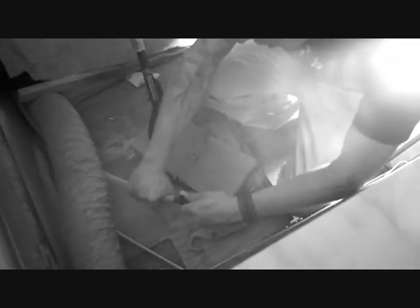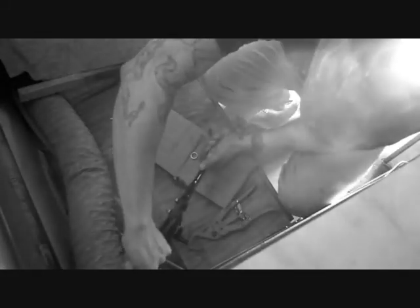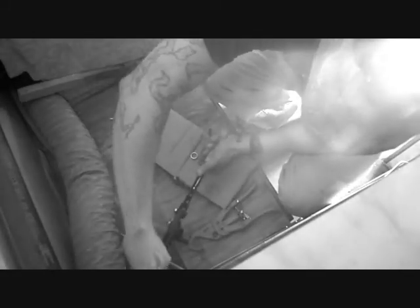Since I got to work in tight spaces, I'm trying to do most of my connections on friendly ground. The hot water for the sink is going to be coming this way, so I'm just going to angle that, just so it's pointing a little more towards the sink and not so straight up, so the pipe doesn't have to fight the curves and bends that naturally come with the pipe.